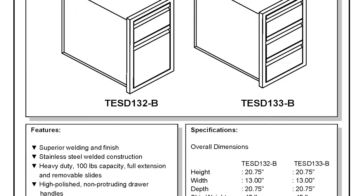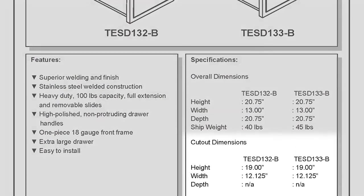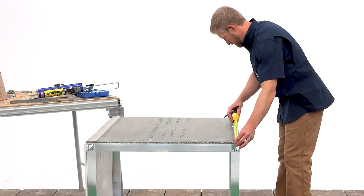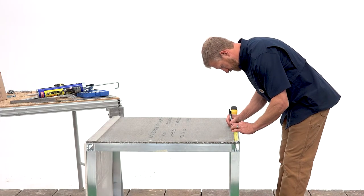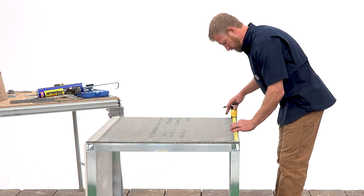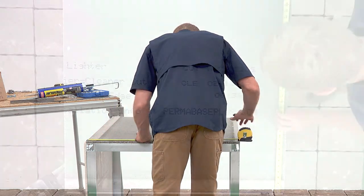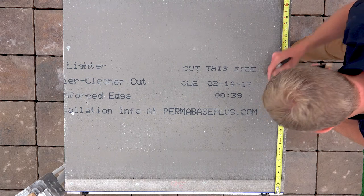The doors or drawers you selected will come with rough openings direct from the manufacturer. These are the dimensions you need to cut out for your doors or drawers to fit snugly into the cabinet. First, find the rough openings for your drawer provided by the manufacturer. As an example, let's say the rough opening is 28 inches wide and 18 inches high. Find center on your front load base cabinet, then measure 14 inches away from the center in each direction. This gives you your 28 inch wide opening on center.